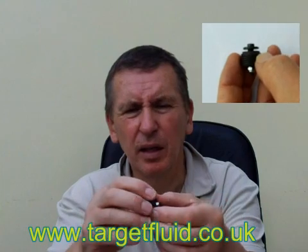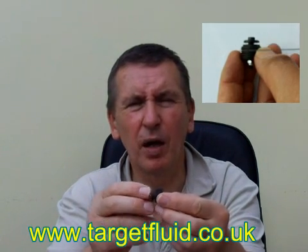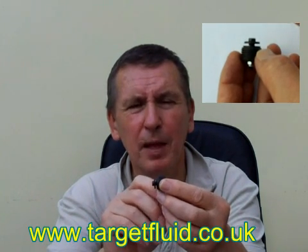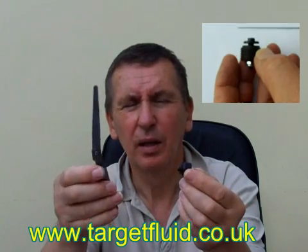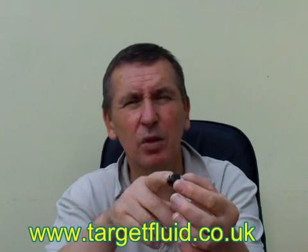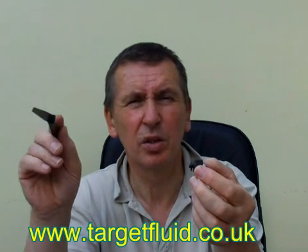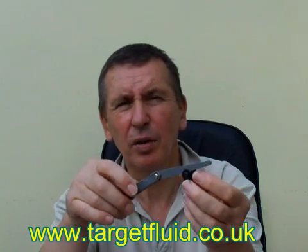The way they work is that you have a cartridge, and in the cartridge there's a little plate. It's a bit like a check valve, but instead of a poppet you have a plate which is held off by a spring from the body. You have to set up this gap with feeler gauges. There's usually a chart where you can look up flow against gap, so if you know the flow — say it's two litres a minute — you go across on the chart and find the gap in millimetres that you have to set it to.